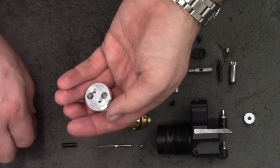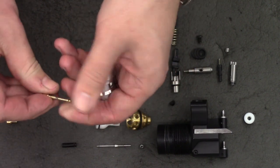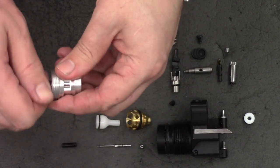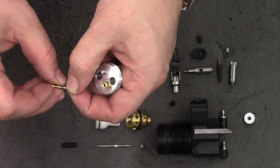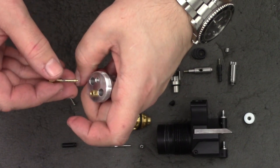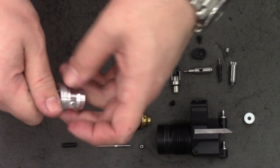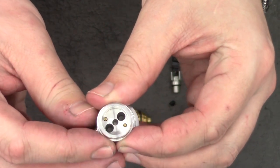First off, we're going to be tackling this piece here. We're just going to take the power jets and insert the springs into them like so. For those wondering, I've run two 1.4mm power jets on my rifle. I did make them myself. I think Edgun makes up to 1.3mm, but I decided quite early on in the tuning of the Leshy 2 that I wanted the valve to be shutting as fast as possible. Just make sure they're poking through the little valve there, which they are.